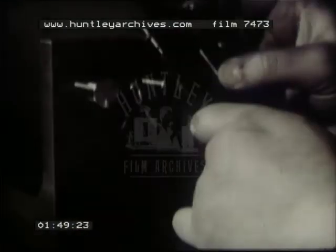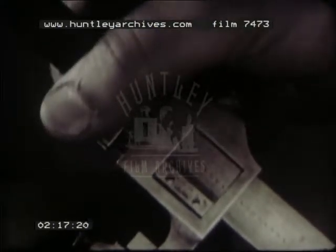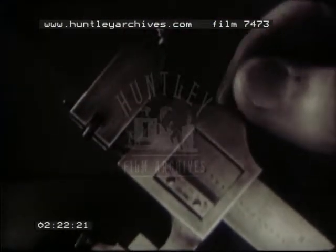A movable jaw assembly slides up and down on the blade and can be locked in place by small screws. The assembly consists of a gauging jaw and a clamping bar. The two are connected by an adjusting screw. When using the instrument, the jaw assembly is moved to the approximate setting. Then the clamp screw is tightened. Final adjustment is made by the adjusting screw. The gauging jaw contains a vernier scale.